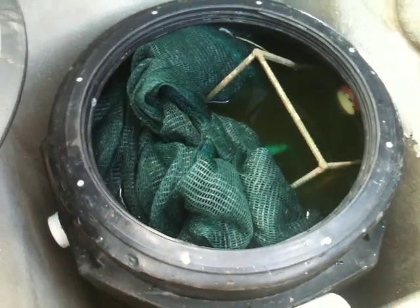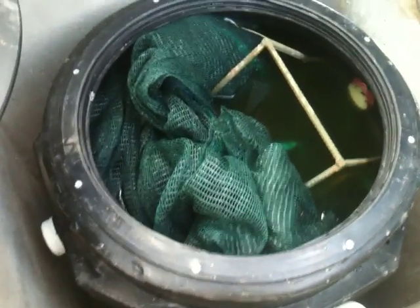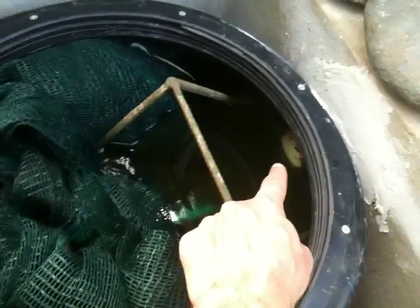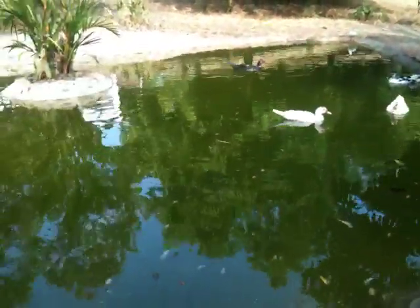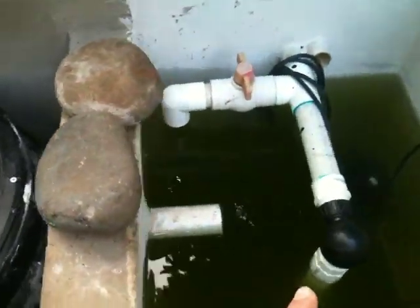Later that'll serve as a surface for anaerobic and aerobic bacteria to grow off of. So anyway, the water enters the cylinder, it flows through the saran, and eventually it exits through that pipe right over there, which in turn ends up setting the level of water in the pond, because since these are connected simply through an underground pipe, the level in the pond has to equal the level in this barrel. So anyway, then the water goes over here into this half of the chamber,